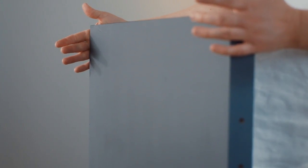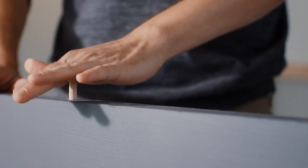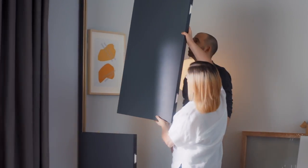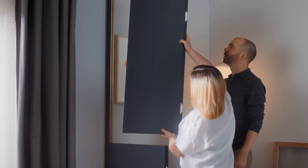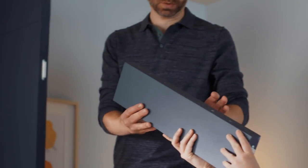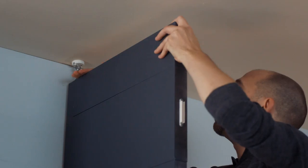Position the bottom panel in place against the post and gently push the clips into the groove of the post. Allow it to lower to the floor. Add two dowels into the pre-drilled holes along the top of the first panel. Then take the next panel and push it into the post as before. Lower it down, ensuring that the dowels slot into place. Using the same process, add any remaining panels above.